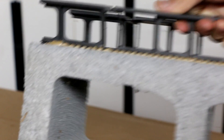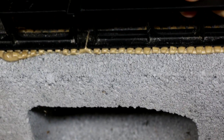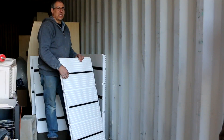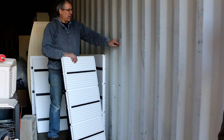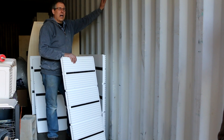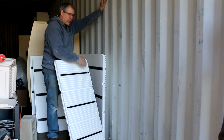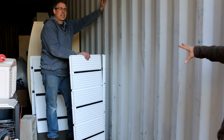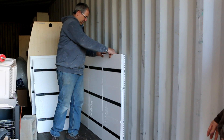All the adhesive that bonds into the ribbed dovetail has almost a hundred pounds per square inch of holding power, giving you over 250 pounds of bond strength per attachment point on the stud. There are six attachment points on average per panel.